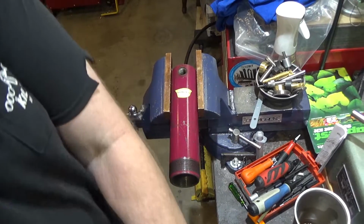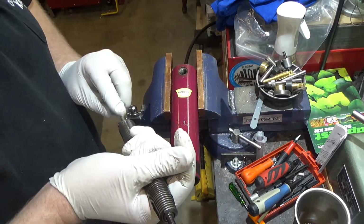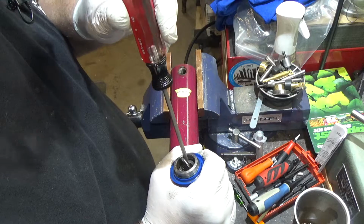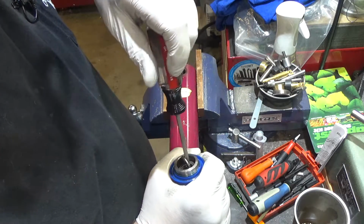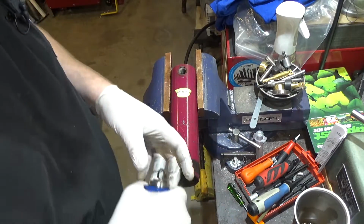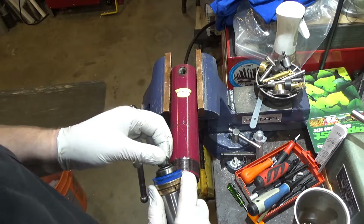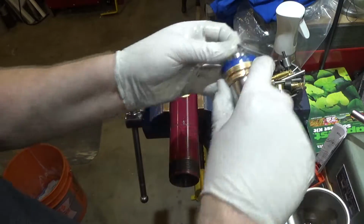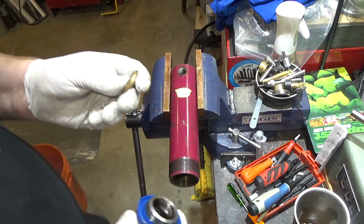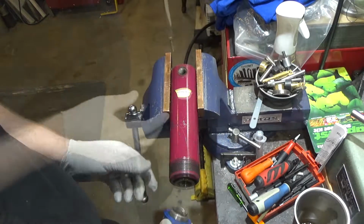So we will. You can get a long slotted Phillips. It's just a Phillips screwdriver here. And we can just start it and tighten it right up. So now we can reassemble this guy. So the spring is in, and, oops, I keep losing these, and these are not good. These bronze bearing pieces are not good to drop.